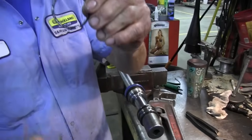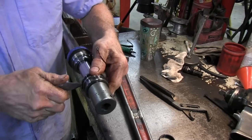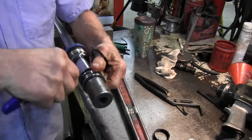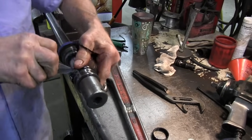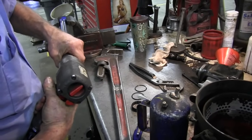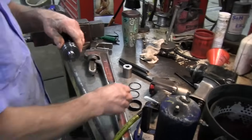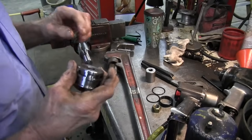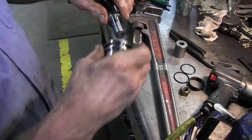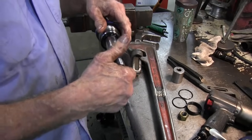They call this a backup ring, and most of them always have two of them. And then they have the actual seal that lies on the cylinder wall. All cylinders will have a nut that holds the piston onto the rod. And some cylinders have a seal - an O-ring that goes in here to help keep the oil from sliding past and underneath this piston and to seal it off.